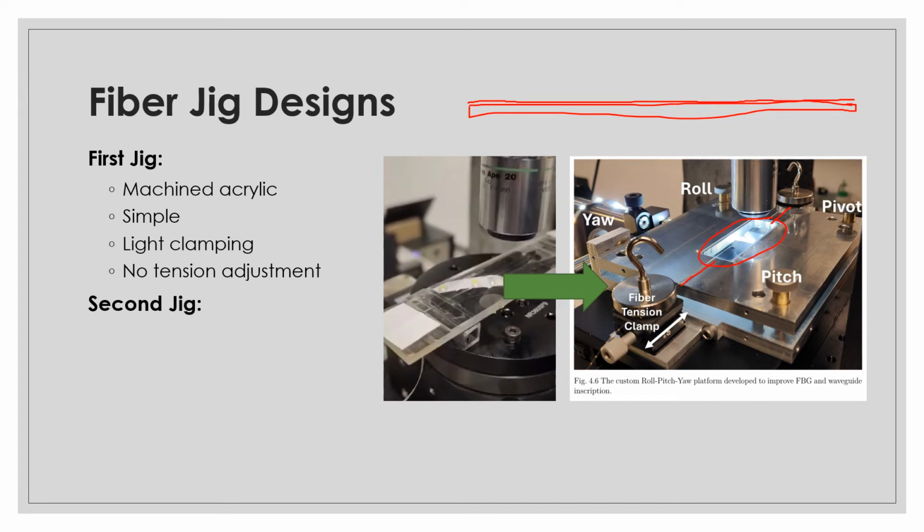And there's one little Thorlabs dovetail stage here, which allows us to apply tension to the fiber. So this meant that I could clamp the fiber very tightly, and we could pull it very straight. And that's important. You want this fiber to be very straight along this distance. So once we figured that out, and we got the pitch and pivot and roll and yaw and everything all straightened away so that we could maintain alignment, now I can maintain the fiber.